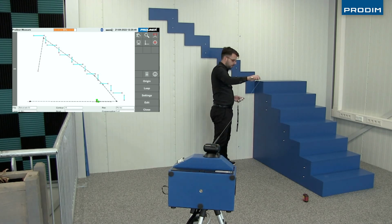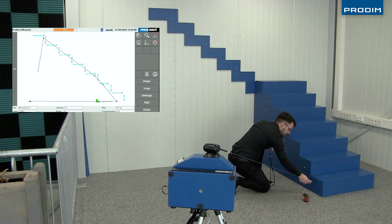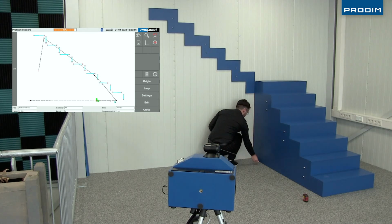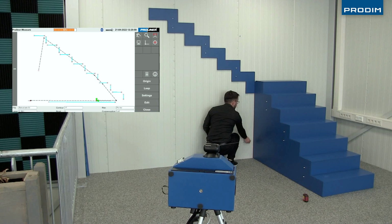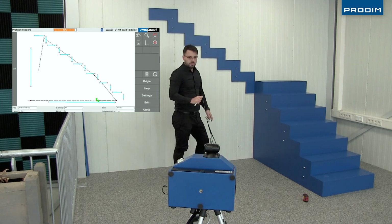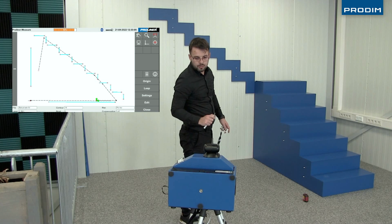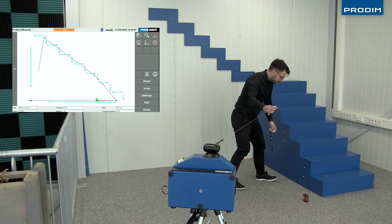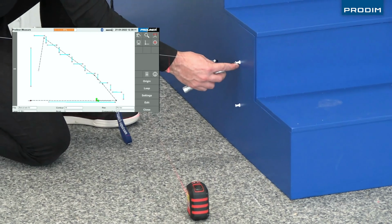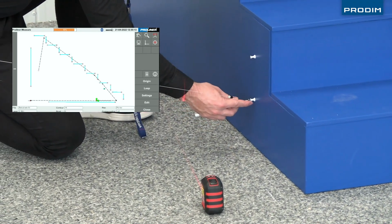The last bit of information needed here is going to be the standoff locations. By centering the ball of the Proliner on those pre-drilled or pre-marked locations and taking a single point by pressing the 1 button followed by the 3, we are then representing the center point of the standoff location, which can then be turned into a circle later in the editing process.